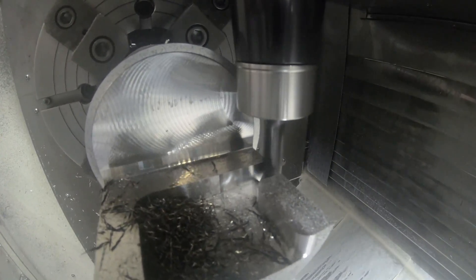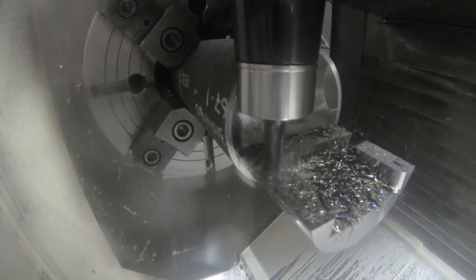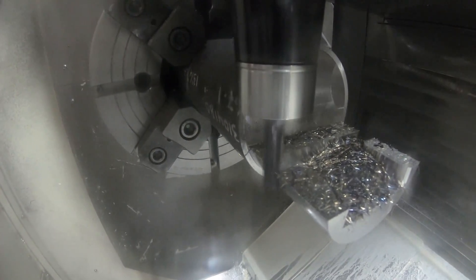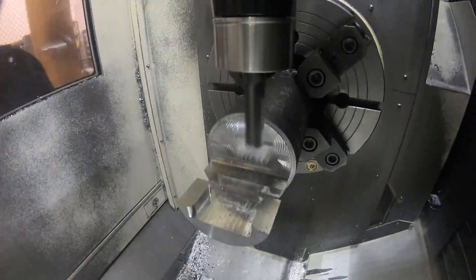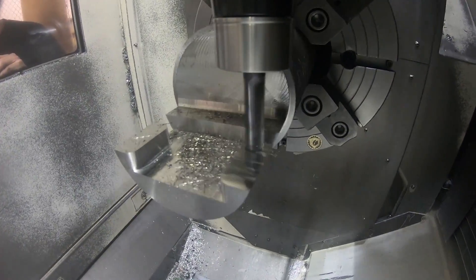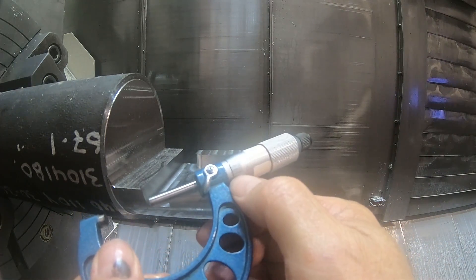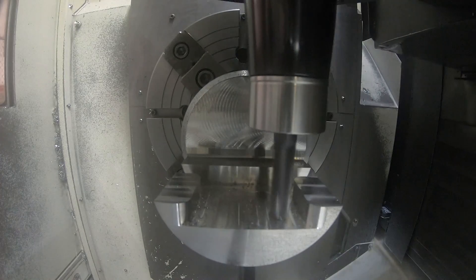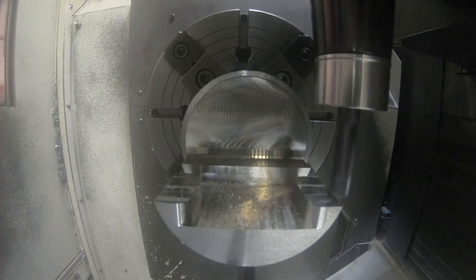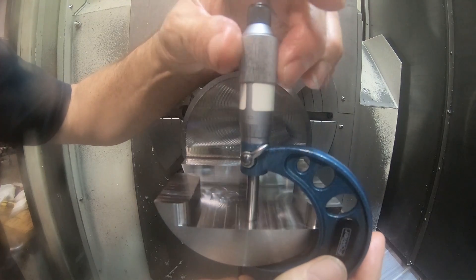That area in the back is just where the part is going to be cut off. I had to go deeper with the feed mill to clear the collet chuck - see how close it is to that face. I'm getting around the back side of the part. There's a finished cut on the faces and the walls. This height has to be fairly accurate because I want everything to run true on the fixture, so I intentionally offset it up and I'll take about three thousandths more off. When it fits into the aluminum mandrel, I want everything to run at the same diameter on the OD. That seems to be measuring the size I want now.